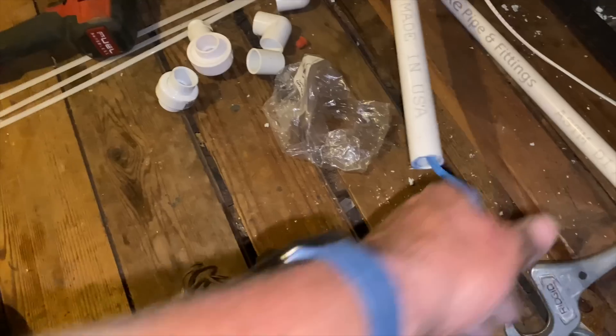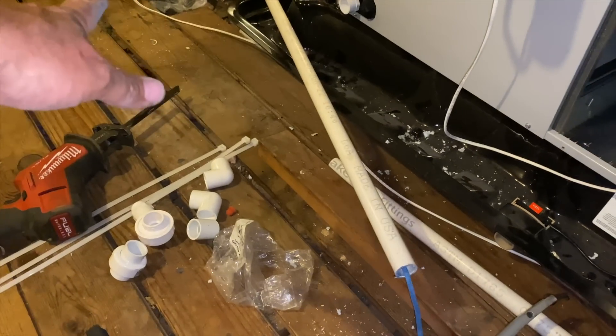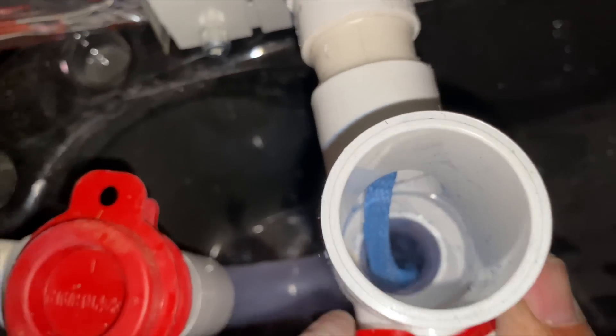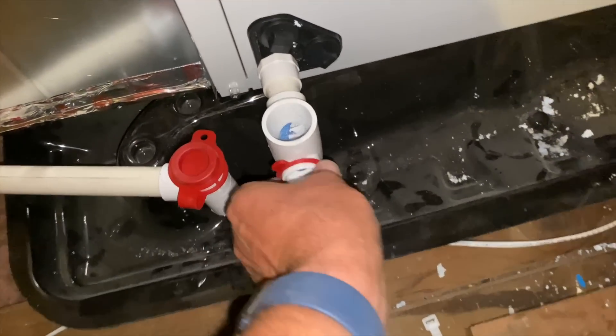For the past 20 minutes, the other Mike and I have been trying to fish an electrician's fish rope through 20 feet of three-quarter PVC drain piping to install this rope. This stuff is embedded with minerals and metals — the main active ingredient being copper — and when you insert it through your condensate drain line from the evaporator to outdoors, it prevents all that sludge buildup, eats away the sludge, and is guaranteed not to clog for 20 years. As you can see, the string goes all the way from the exterior, following roughly 20 feet of three-quarter inch PVC, into my clear trap and then back into the evaporator.